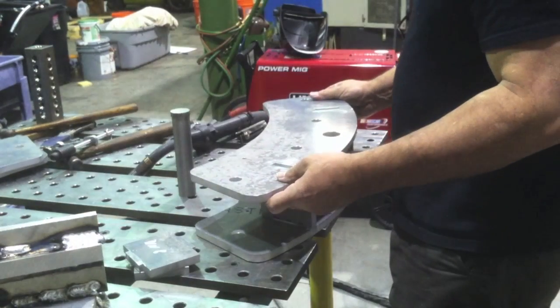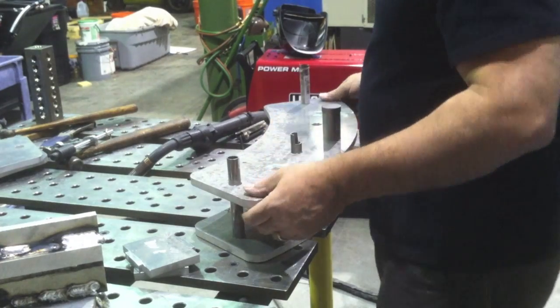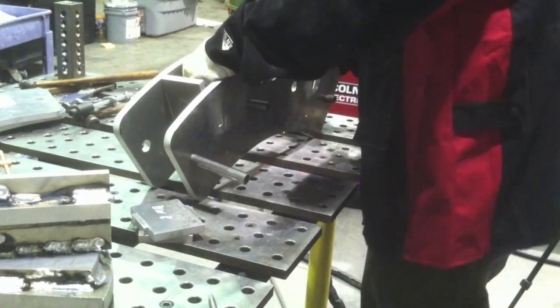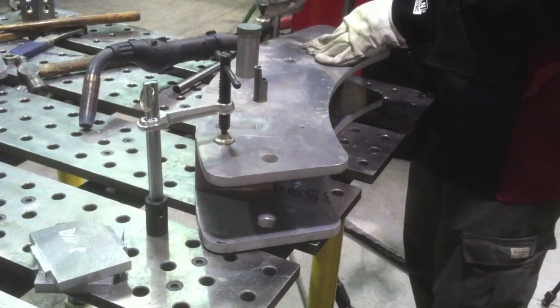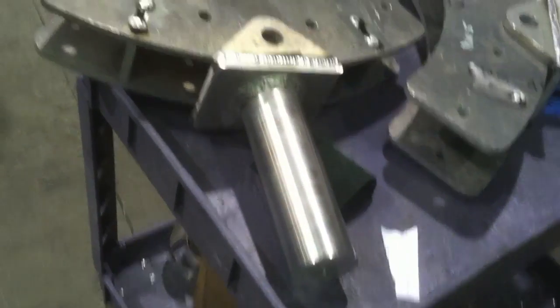You can see these spacer plates have little notches on them, so this really is kind of like a puzzle. This is all water jet cut and it's gravy work — just putting it together. I've got some makeshift pins, some three-quarter inch tubing, and the other big pin to make sure it all lines up. No matter how it's squared up, the main thing is that all the bolts and pins fit in correctly, and these little spacers are just plug welded once everything is set and lined up. For right now I just want to get tack welds on those places where they're supposed to be plug welded, because I don't want to grind that weld out if something doesn't fit. I'll make sure the wheels that are specced to go in there fit before I do any final welding.